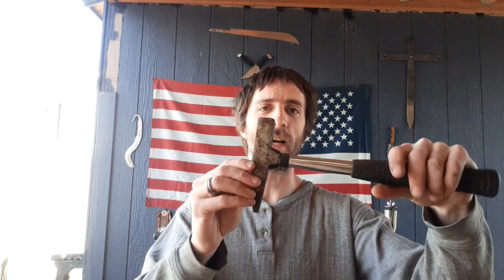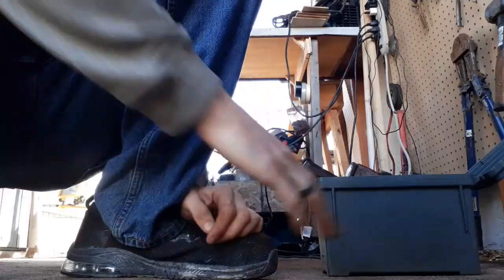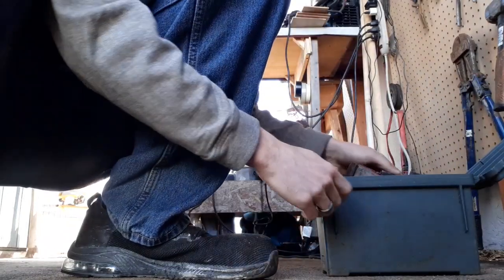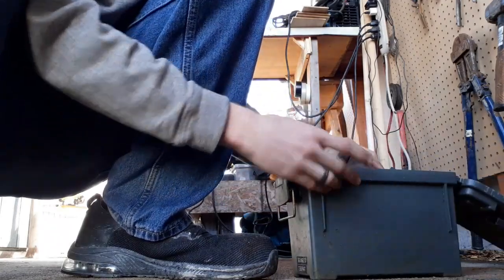Aside from that, I've got various hammers down here — ball peens, rock hammers, stuff that I use like a drift for axe eyes. This is just a simple little hammer that I use like a top tool. I softened this end here, so this end is the hard part. This is my axe eye drift for my bigger projects — you can use it for hammers as well. I prefer a square or diamond eye on stuff, it just looks interesting to me. Down here, my anvil stand is right where you are, and this is all my other various tools that I need access to quickly.